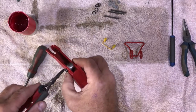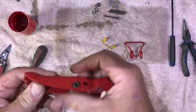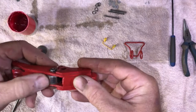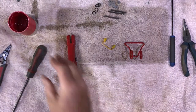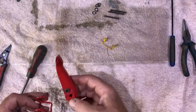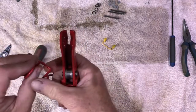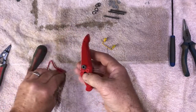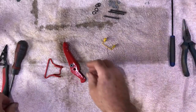Second circlip on. Jobs are good. Right, one roller bearing put back in. Now, next thing, the anti-rattle spring. The rattle spring obviously opens there and one end goes into each of that pin. There's just a slight recess in it.